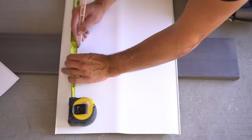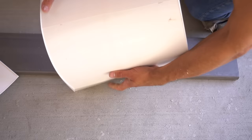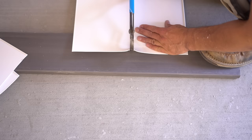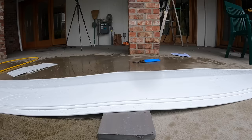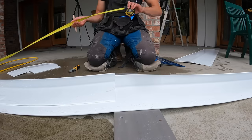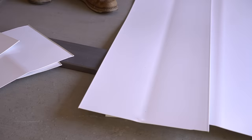It is now finally time for our V paneling installation. This material was more difficult to cut on a saw, so taking a very sharp utility blade and using a straight item as a guide to score the material and then break it off is the perfect way to cut it to the right length. At the lowest point of the V paneling I take some pliers and crimp the very end, that way we can control the rain runoff more smoothly and avoid any awkward dripping. After doing this a few times, I realized the fastest way to cut all these panels is to line them up and use a large contractor square as a guide for a perfectly crisp line.